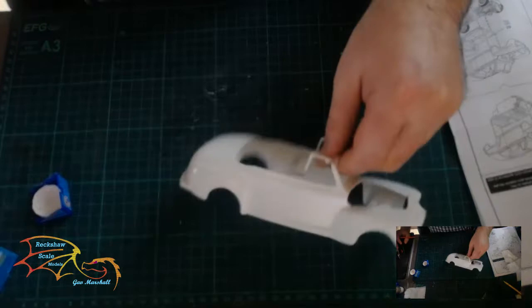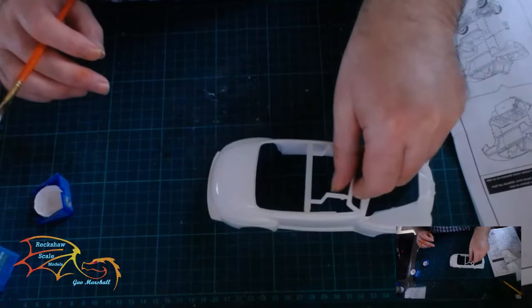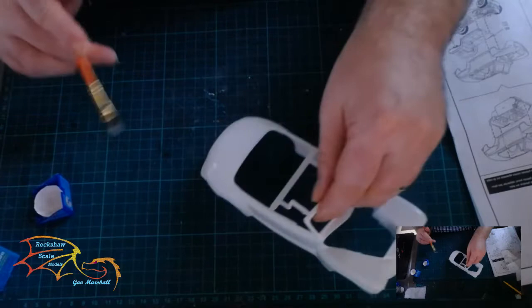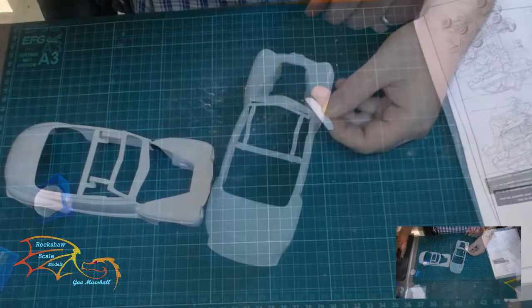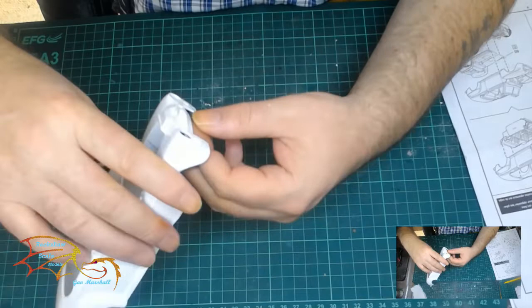But just turn the light off there, you can see the difference from the primer to the actual gloss paint. So I'll put on about 3 coats of the white. And so I've left that to dry. It took about 3 days to do this, I should point out. Each coat, I left to dry overnight. Now, that's not really necessary with acrylic paints, but because it's the light colour, I wanted to make sure it was completely hardened before I put on the next coat. A bit excessive with time waste, but there you go.